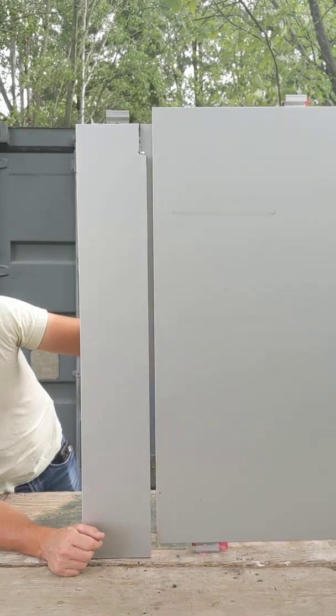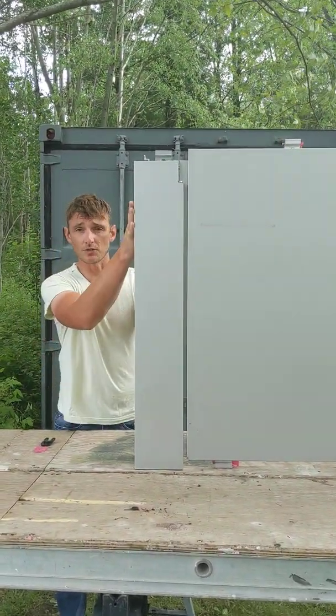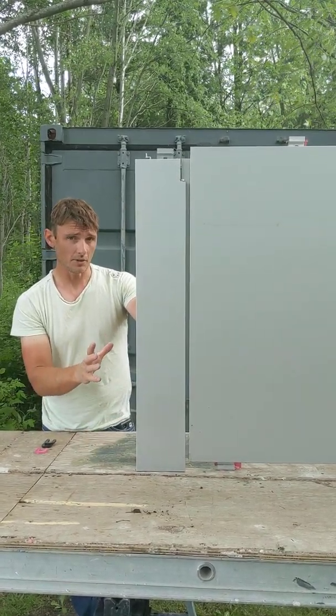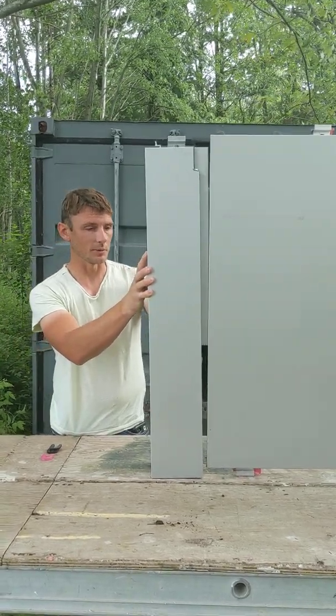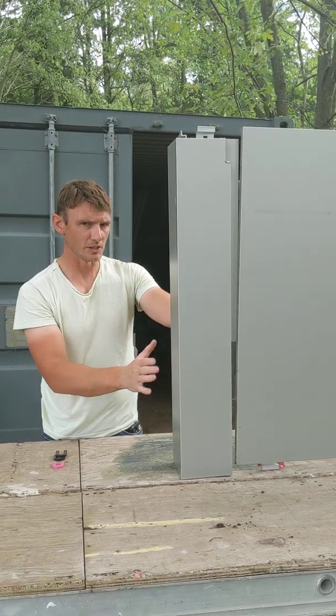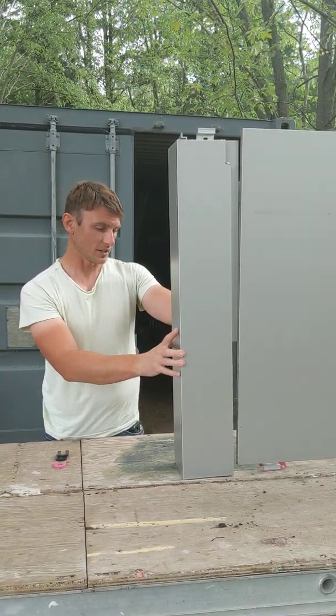So that's basically it. You want to make sure you're running plumb, that your corners run straight as you stack these. That's really important because they all lock together. If you run off — if you start your first piece crooked — you're in big trouble. So it's very important to make sure you start out perfect, especially on a larger wall. So that's it, that's the basics. Thanks.